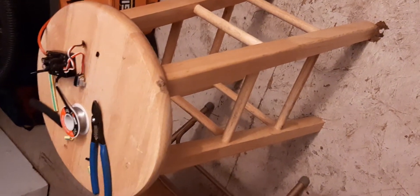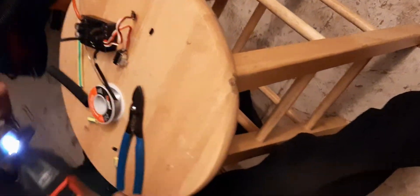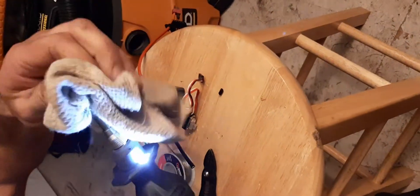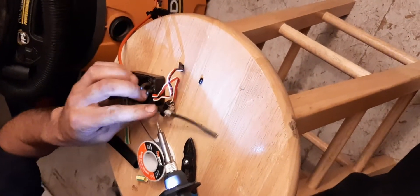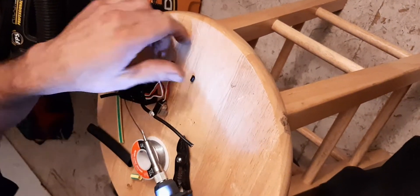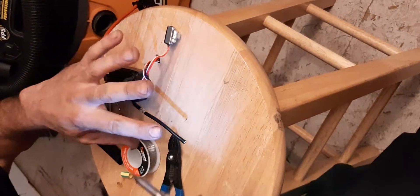This gun is already hot — I turned it on, and that's about 30 seconds, that's all it takes. Take yourself a rag or something like that, wipe off your tip. And then basically what I do is I either have another person hold my component that I'm soldering, or I set it up on the vise or whatever to hold it, so it's basically a flat level angle.